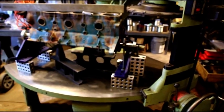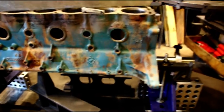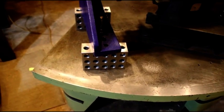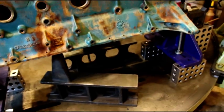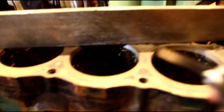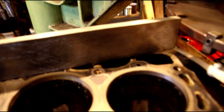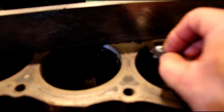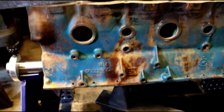Finally got the 258 on the block master. Quite a bit of setup here - I've got some 2-4-6 blocks under the stands and some five-inch risers with some jacks on it to get this in the exact right position. This feeler gauge is a 6-thousandth feeler gauge - it just glides right under there, in and out, sliding under there, and finally tight over here. So we know we're out at least 6 thousandths - we've got some twist in that block.